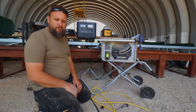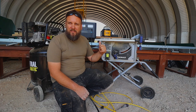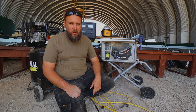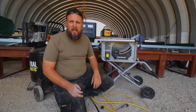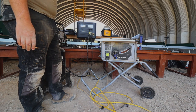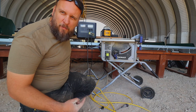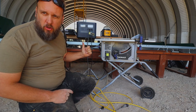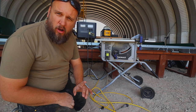The table saw is running 300 watts, and it says you could run it continuously for three hours. Now let's get really crazy and see if this power station will run this air compressor and this table saw at the same time — I really don't think it will, but there's only one way to find out. It's got overload protection, so you're not going to hurt the unit. And it works! I'm running a two-horsepower air compressor and a table saw both off of one power inverter. That's running 1920 watts — it would run for one hour.